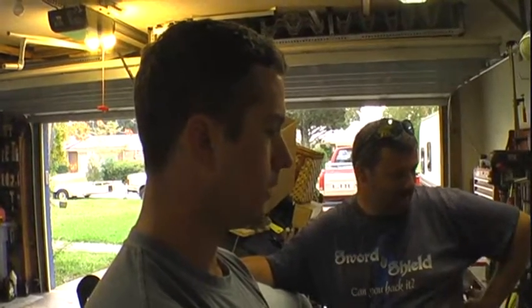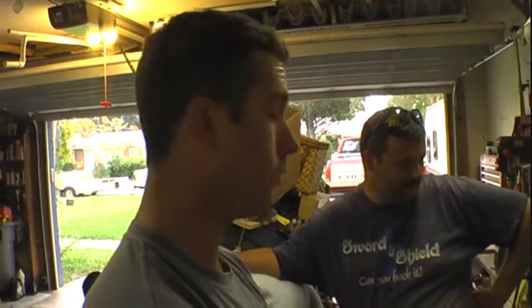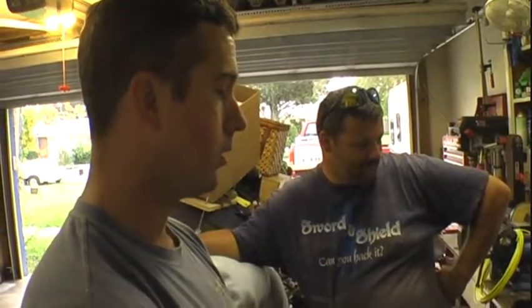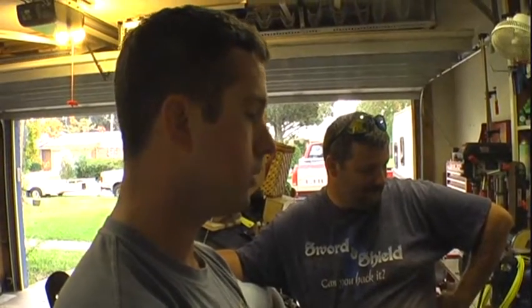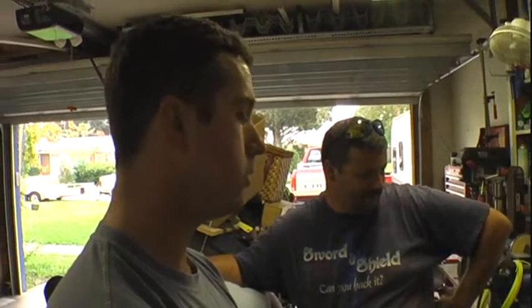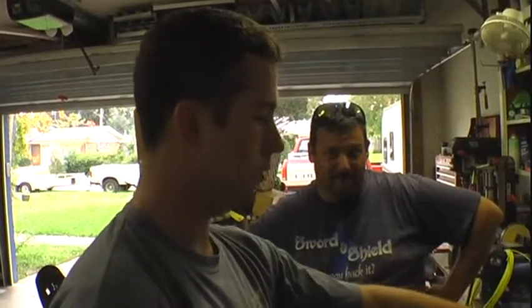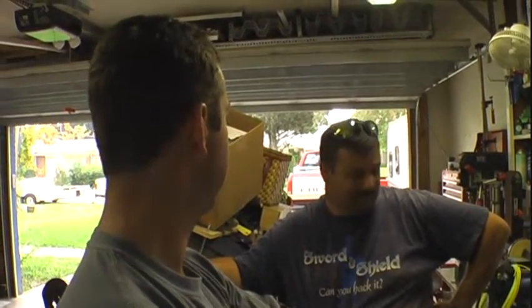You need three things for ignition and burning a fire, and that's fuel, oxygen, and reaching the flash point of whatever it is. And you have oxygen, you have hydrogen, so you got fuel and oxygen. All you need to reach is the flash point. Once you do that, it's not going to burn at the tip. It's going to follow it all the way up the hose and blow the top off because it has its fuel and oxygen in there.